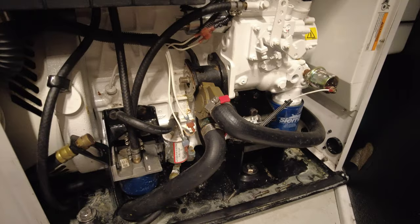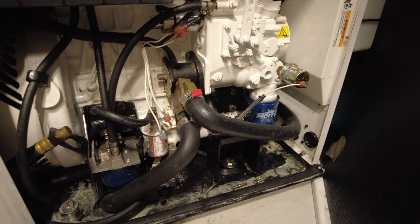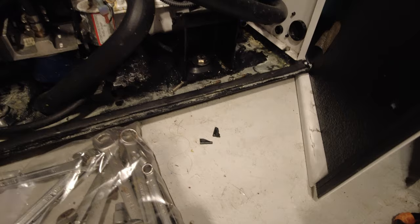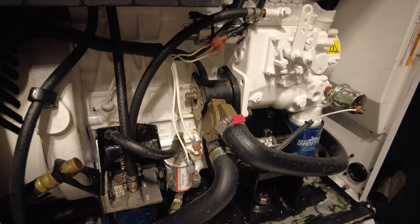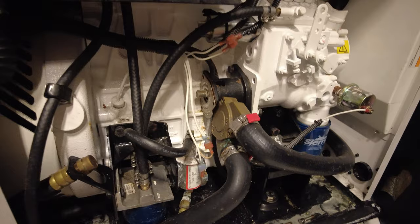There you go. Be careful, a lot of mechanics will say, yeah, I fixed your impeller for you, it's all working, it's great. But obviously, if you've got little pieces like that stuck inside your heat exchanger, it's not as efficient, is it? It's really, really hot down here, so I'm breathing heavily, but, you know, it'll work, but it's not as efficient, right? So if you're in the tropics like I am now, it'll not cool the engine as well.